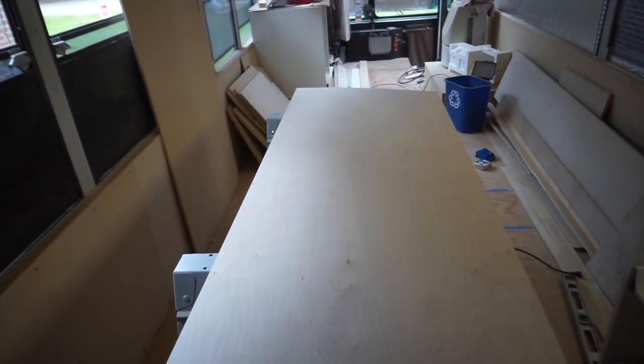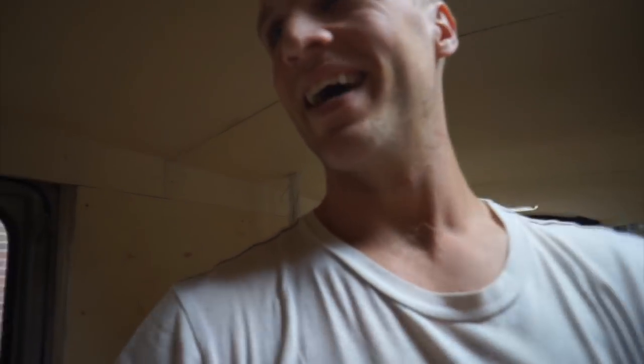We have our last three-quarter inch plywood wall to put up. That piece of wood took me like maybe three hours because you have to scribe the top. You've got to guesstimate the height, so I've been going on the taller, tighter side. I have to keep adjusting the piece of wood as I push it into the wall. The wall is not perfectly square, probably because of the spray foam at the bottom. So then I have to start scribing the side that touches the wall and adjusting the top — small adjustments with sandpaper — and that's how I get a tight fit.